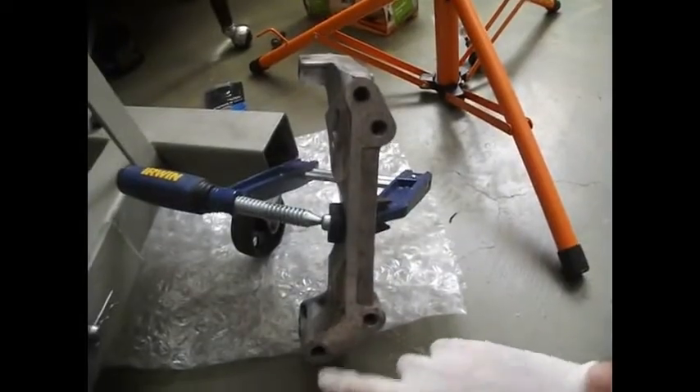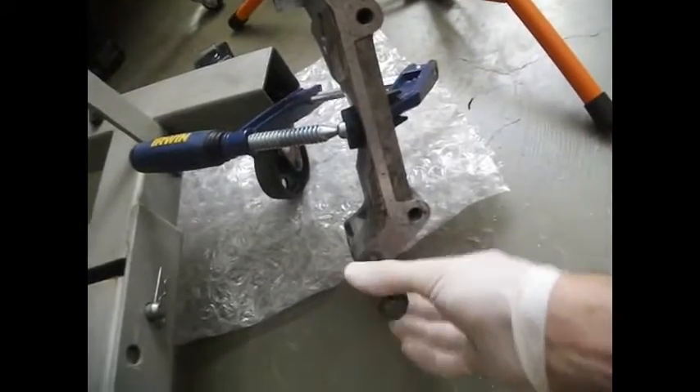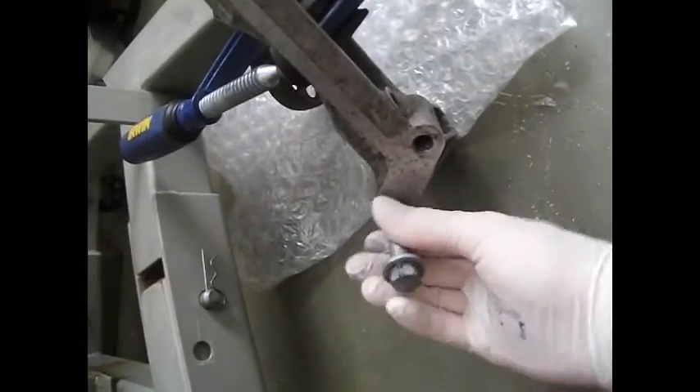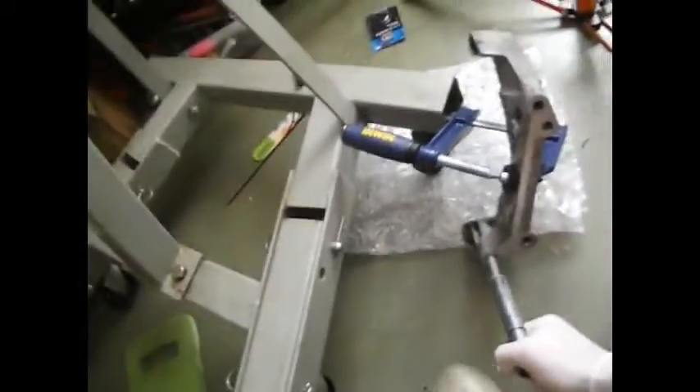These three are okay, see, but this is the problem. What we're going to do is we're going to fix the thread using this. See what happens is the bolt starts to go in. However, just keep an eye on that thread there. It should stop around here — that should be it. I shouldn't be able to turn it more. But unfortunately, see, it keeps on turning and the thread disappears into the hole. And if I grab this mini wrench, see, it continues to turn because the thread is stripped.